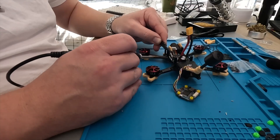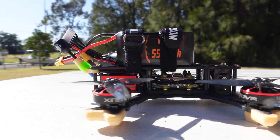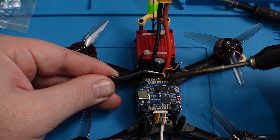Now that we understand the differences in each of these digital FPV systems, let's put the HD Zero Freestyle V2 on a build — one where the original Freestyle VTX would absolutely not fit. I chose to put the V2 on a quad previously running a DJI O3 Air unit: my Quadmular Siren F3, which is a 3-inch freestyle FPV drone. As you can see from the small form factor of the V2, it's perfect for micro builds, and because it fits a 3-inch, it'll definitely fit in a 5-inch as well. Wiring the V2 to the flight controller is reasonably straightforward, but watch out if you're using the included plug with a flight controller that has a DJI or HD plug — you'll need to repin the connector to line up with the right outputs.